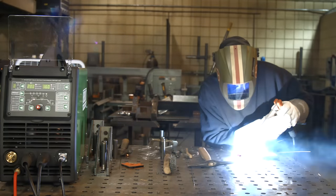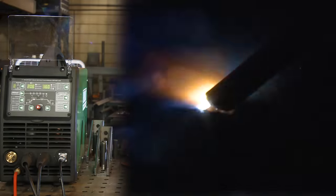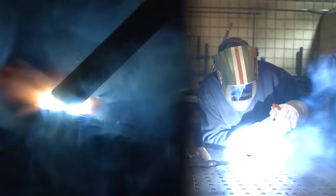I need to explain what I'm seeing and what I'm feeling here. I have this rod leaning back probably about 40 degrees or so. I also have it pointed toward me about 10 degrees, just so I can get that slag running behind me.